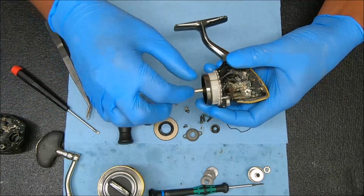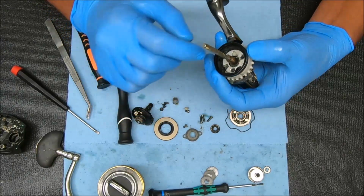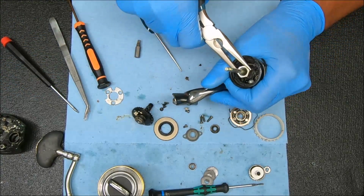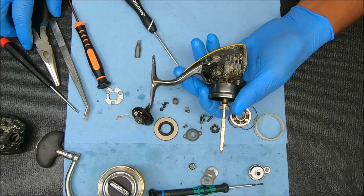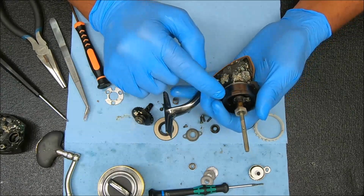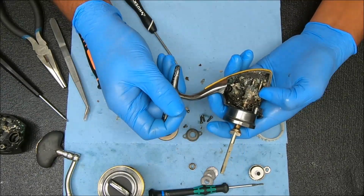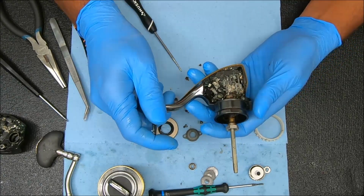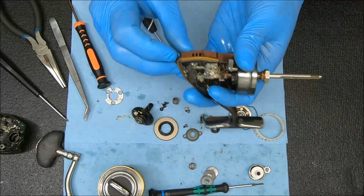Now I took the main gear out, or the drive gear out, so still trying to turn this. We see a lot of stuff happening in here. I'm gonna guess it's up in here somewhere. It's looking like that pinion gear in there is what's frozen. But it certainly might be a lot of other things. Yeah, we got this shaft, or the block, trying to move along with this pinion gear when we're pulling it out. So I'm going to make the assumption that this is just beat up and is not going to work. That's terrible.